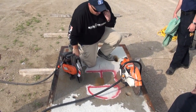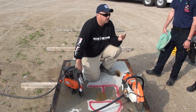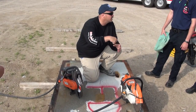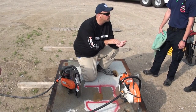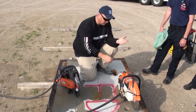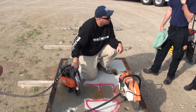Run these saws wide open — that's the first thing. For the water mixture, think of it like chocolate milk your kids made without supervision, just dumping powder in until it's thick and nasty. That's the consistency you want. If you have too much water, it creates a layer between the concrete and the blade and you won't actually be cutting. You want just a little bit of a thick milky substance coming out the back.